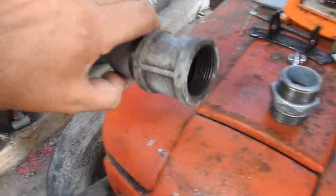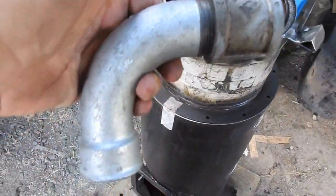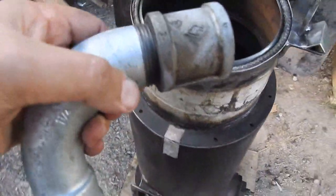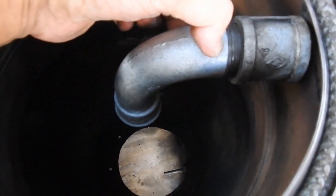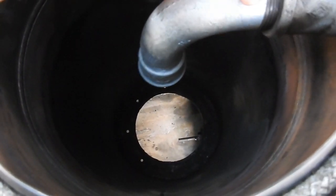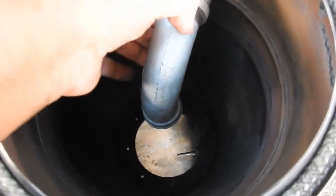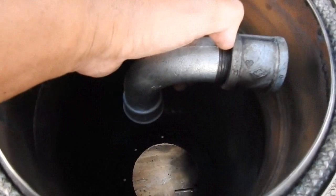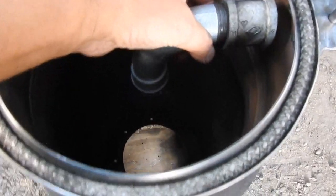This looks about right. Now, something Flash told me in a recent comment was that it was better to run the air inlet down the middle all the way to the burny bit at the bottom, instead of coming in close and then doglegging out to it. And yes, I tend to agree. Doing it this way, we don't have our fuel getting bridged here.